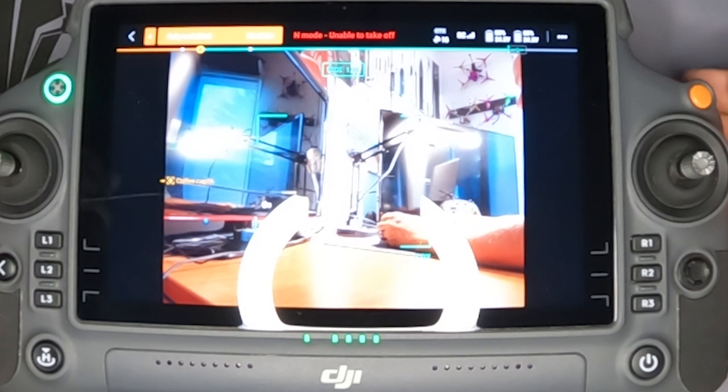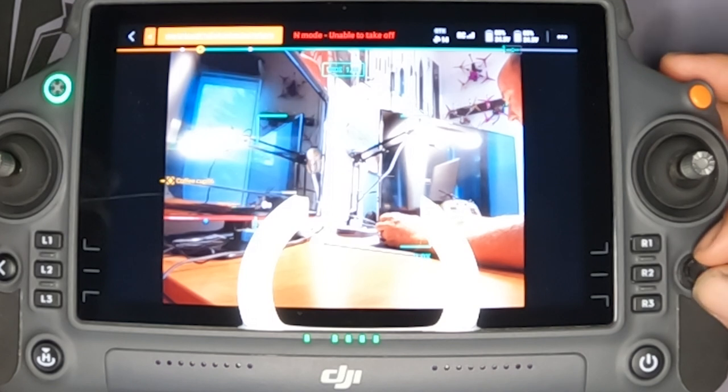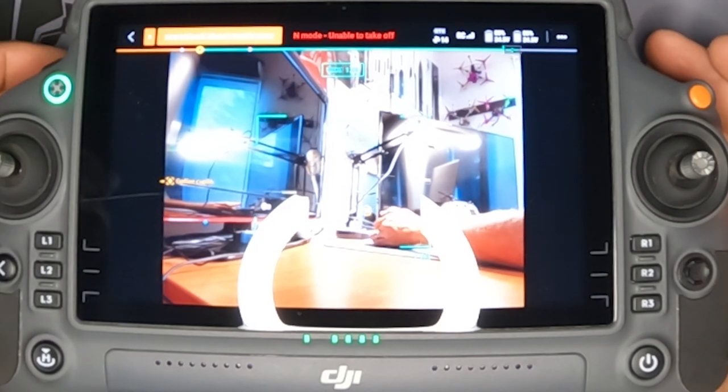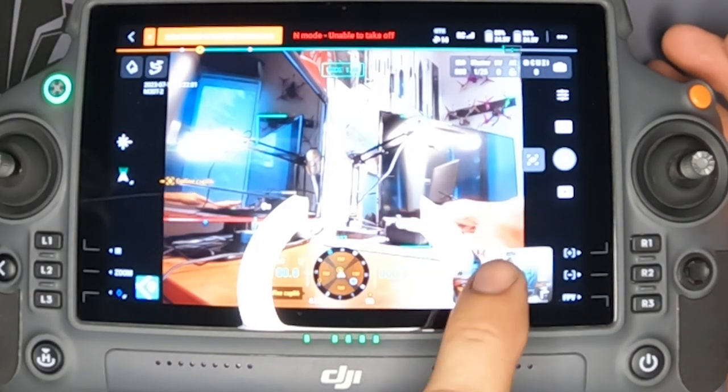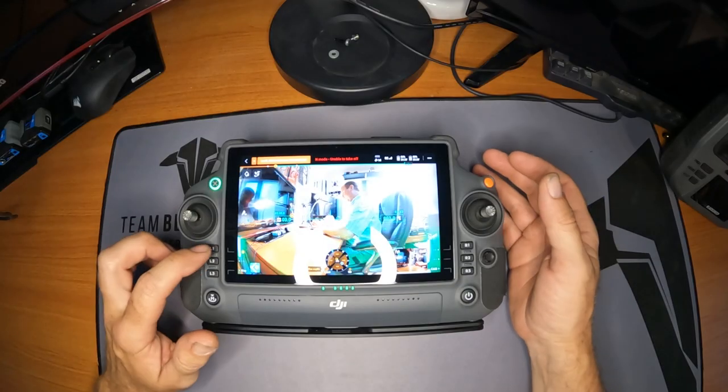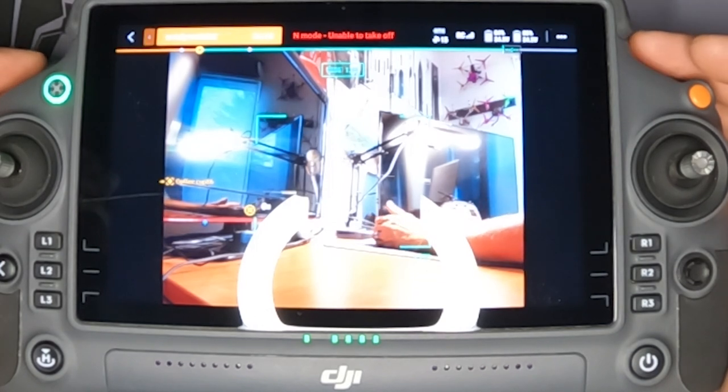At the last training we talked about this 5D button. I said you could set it up multiple different ways. We originally had it set up so up was beacon and down was discrete mode. We did those at night for hot-swapping batteries so you didn't want the light flashing in your observer's eyes. You could quickly go down without fumbling through settings or going into your FPV camera to hit the beacon light.